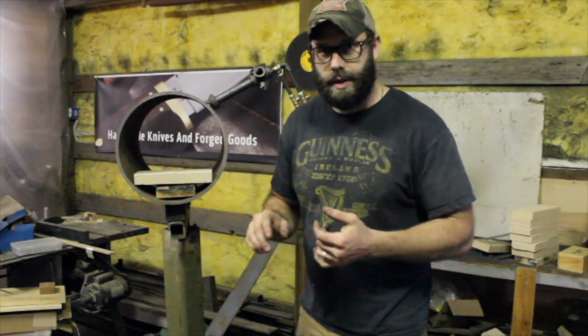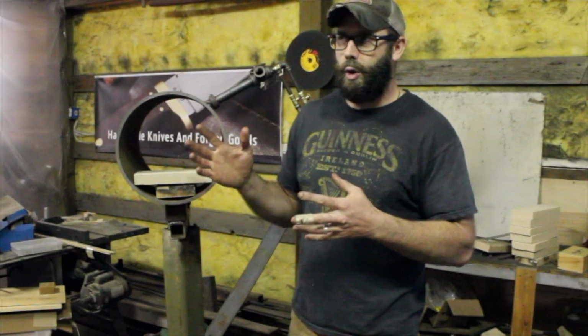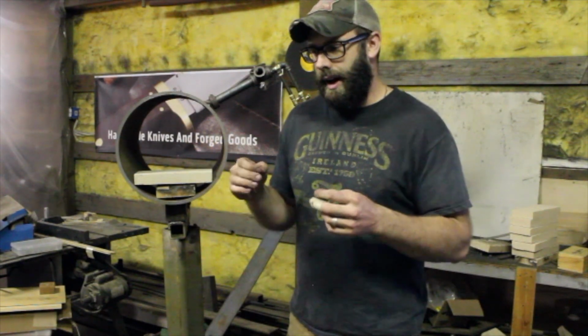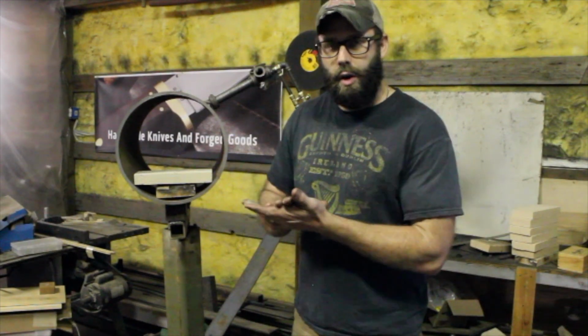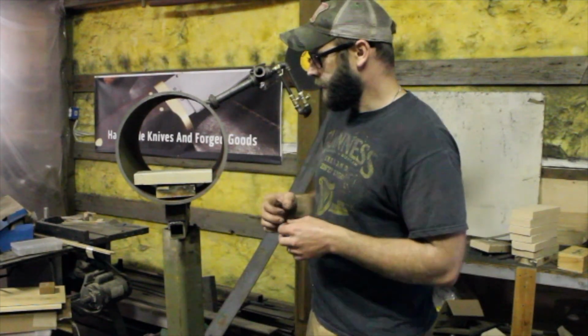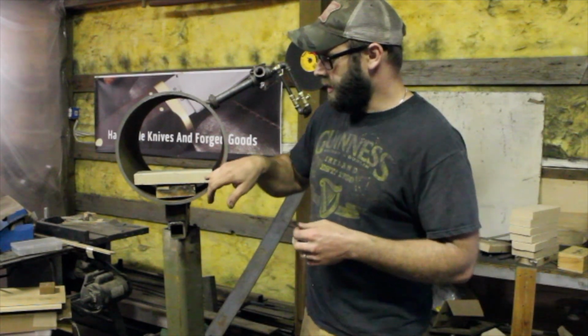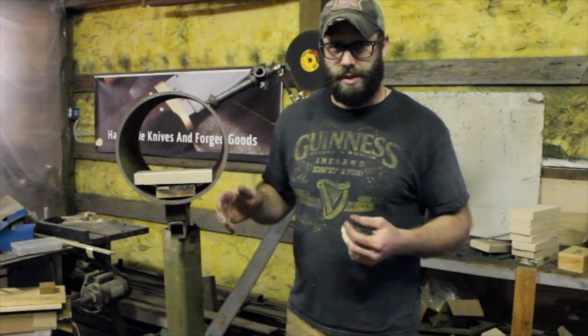but 2 main ones. Primarily it's going to be insulated with K-wool, or the equivalent, which is a ceramic insulation. It looks like a white version of your home insulation, but it's a high temperature ceramic material. And then I'm going to use for the replaceable floor the inexpensive, I think they're like less than $3 locally